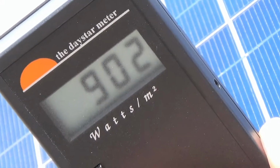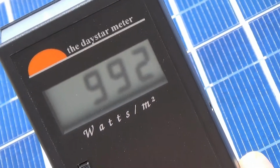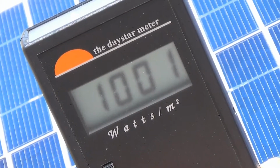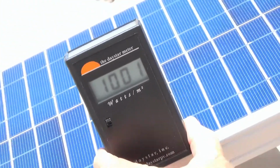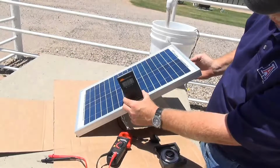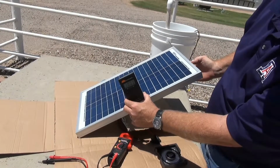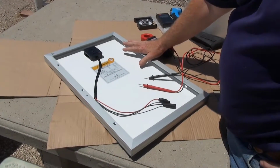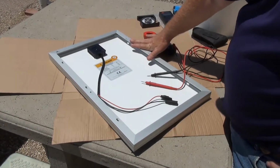So it's important that when we set up our modules, we find the ideal angle. So at the peak sun hour of the day, which would be from about 12 p.m. to 1 p.m., we can maximize on the most irradiance available. So we've already talked about proper angle towards the sun, and we've talked about watts per meter squared.